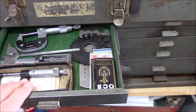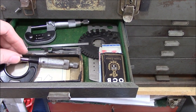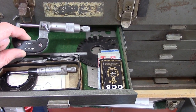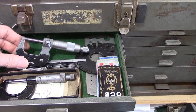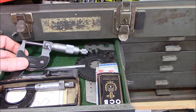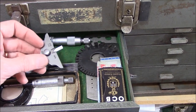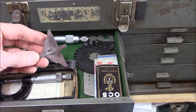When you do your precision work, you're going to need a micrometer. This is a Starrett micrometer — my dad bought it. This Chinese version of a zero to one inch, you're going to use that when you're building small engines almost 100% of the time. But if you need to do something else, you can get some bigger mics. This is a measuring gauge that goes inside and can also be adjusted to measure some angles.